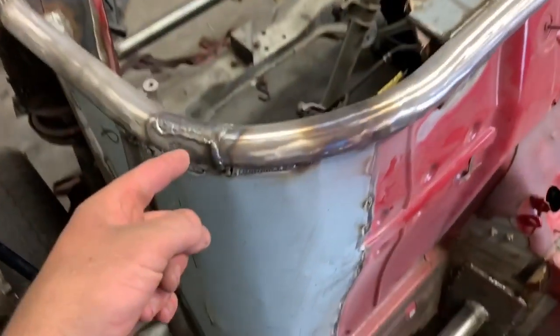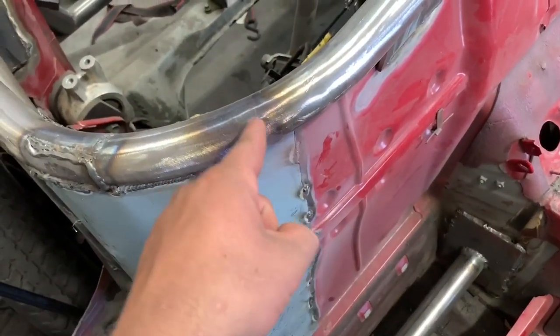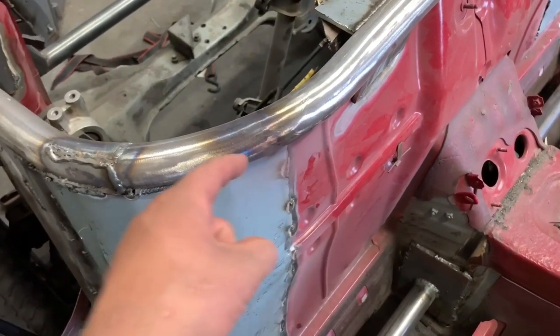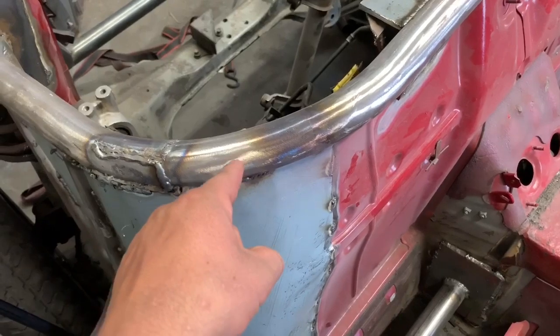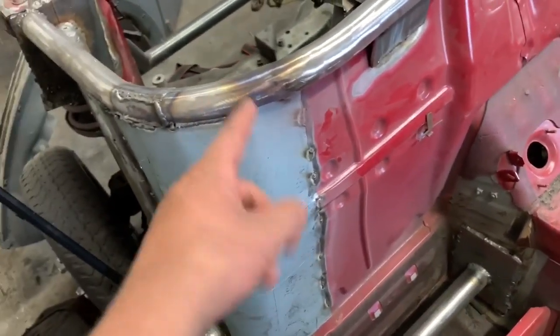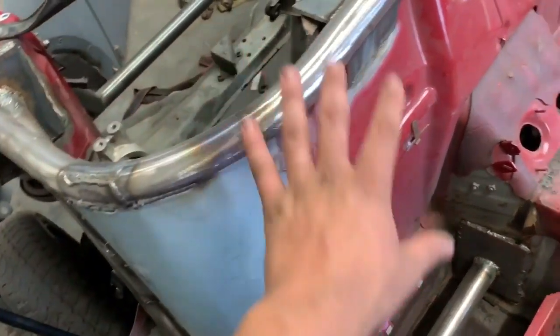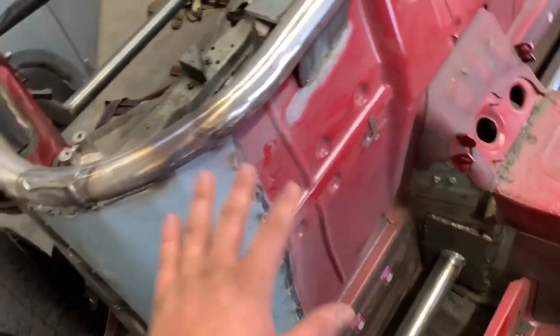That side is a little bit off, but you're not gonna see this. Also, I wanted to point out, right here where those little nubs were that I cut off, do not do that for roll cages. This is more for looks than structure. However, it is strong, but I would not do anything like that for roll bars. This is meant for structure, basically of this tin foil, not for my life.